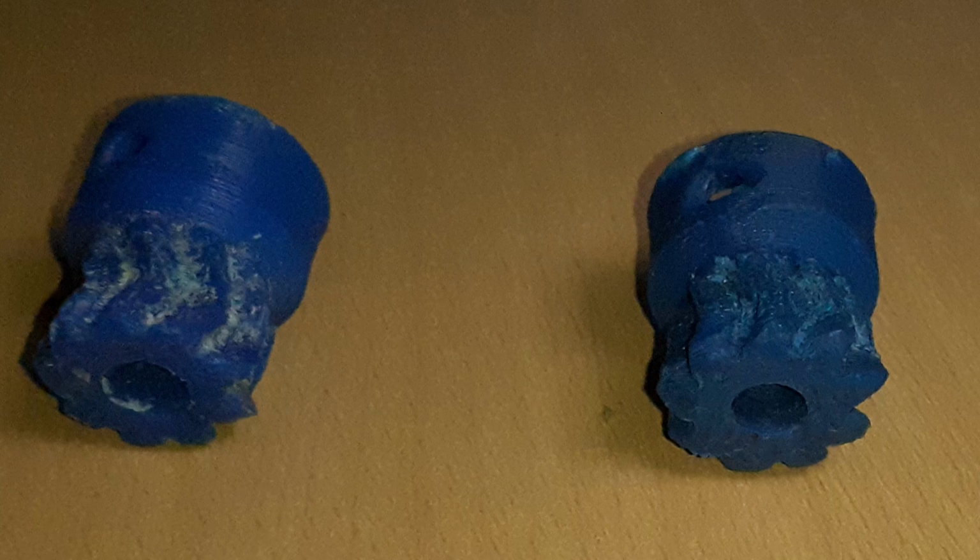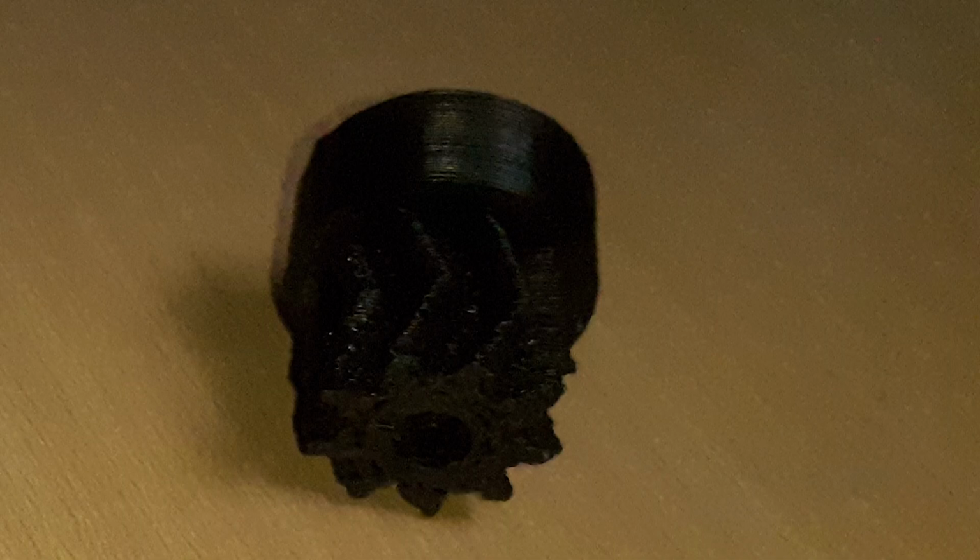If you compare the thickness of those gears with one that's freshly printed and barely used, you can see this is quite a bit narrower up on the teeth here. And the teeth lost their bite and they couldn't spin the larger gear anymore. So fortunately, I always print an extra one. The first time one of these wore out, I realized it was kind of a consumable and I needed to have extras on hand for when it did fail. I was able to pop this in place and print a couple replacement gears.